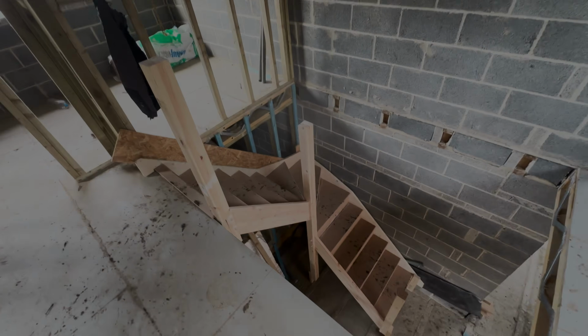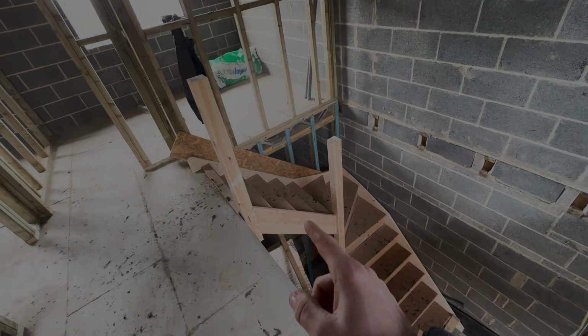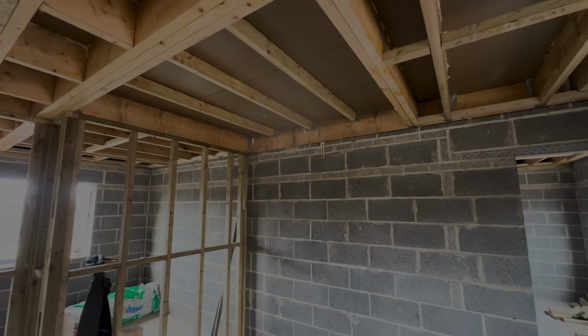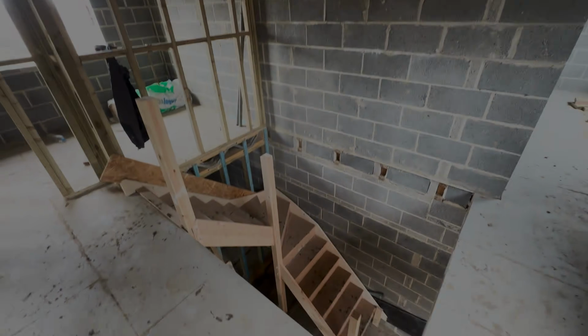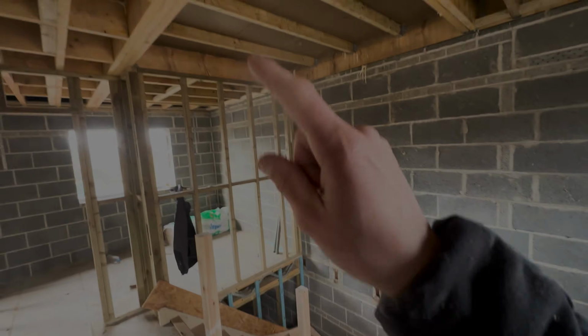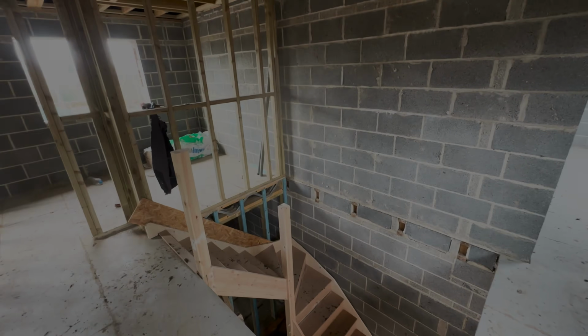So now our first job is we're going to tack that wall like that, and then we're going to strip them temp joists out and get everything cleaned. We've then got a stand that we'll put here, screw to the nail, screw through the floor and put a brace on it, and then we'll get a timber on the wall here so we can get some boards thrown across, and then that will give us access to get these newel posts etc. in, and I'll show you when we get to that section.